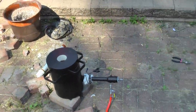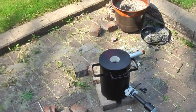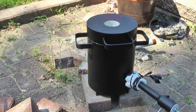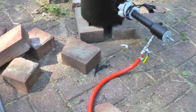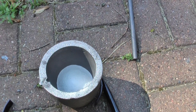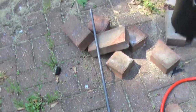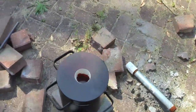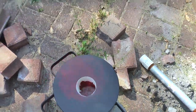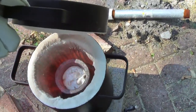It's the first run, hooked up to the propane. What I'm doing is seasoning the crucibles. I have filled the crucible about a third of the way full of borax — I've got a little one in there right now. And as soon as it's melted — it's melting a little bit in there. Let's see if we can get a better picture of it. Yeah, there it's melting.